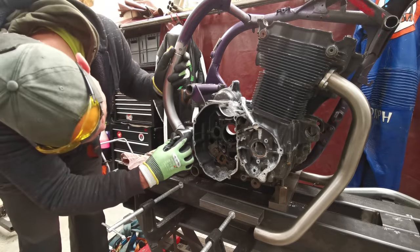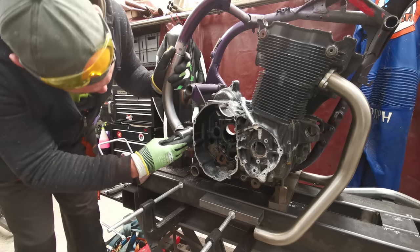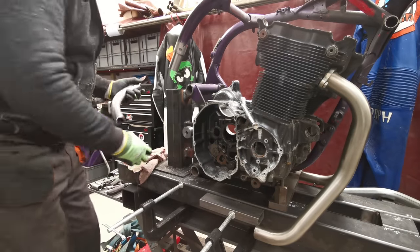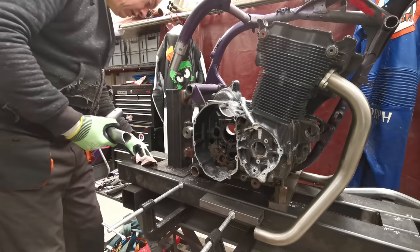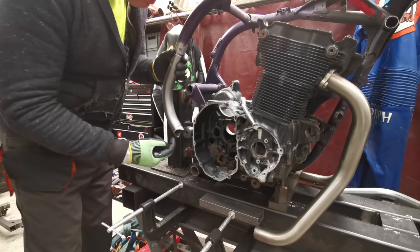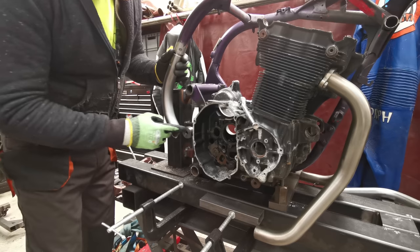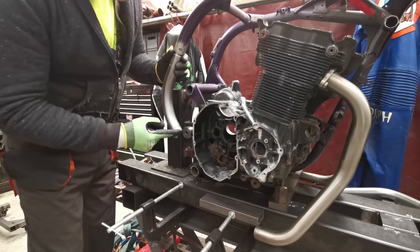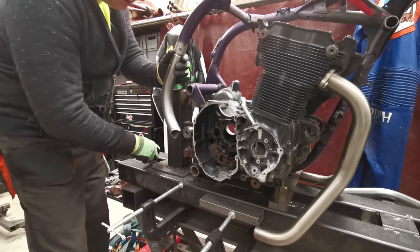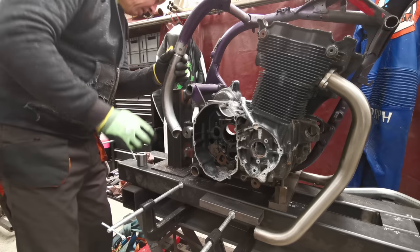So we are close, and as always, it's these pointy bits that are in the way, so I need to trim those down. The angle doesn't look bad, we just need to move that in a bit. So essentially, this is where you just start fiddling. That will get you close. You can see the shape of the tube and everything else, but these pointy bits, because you've got the depth of the material as well, you always end up rounding those off top and bottom, and as you do that, this tube will sneak further in. The tube that's going that way, the boss in this case, will sneak up this tube, just because everything gets to be a bit of a snugger fit.